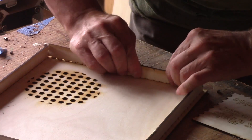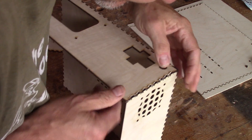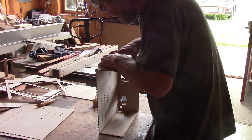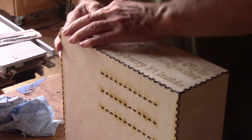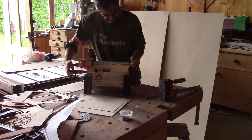It's possible to glue the case. I begin with the top, followed by the main box. Like last time, I put a drop of glue between the fingers and put each piece where they belong. Putting together a box with hundreds of finger joints is pretty rewarding — maybe you've done it yourself. When every piece is in place, I put several clamps.